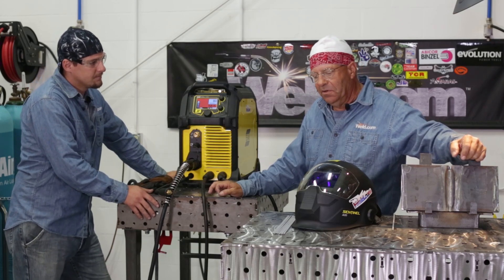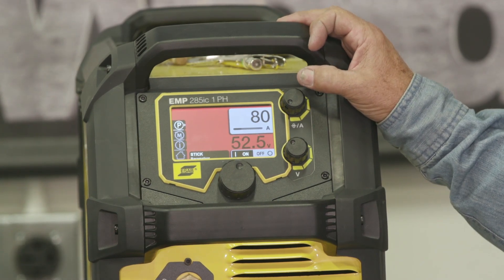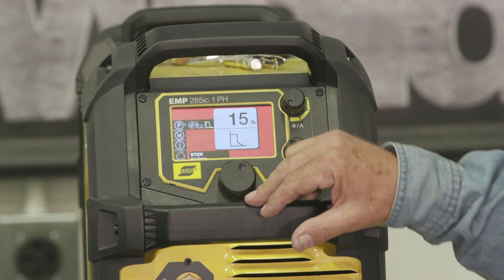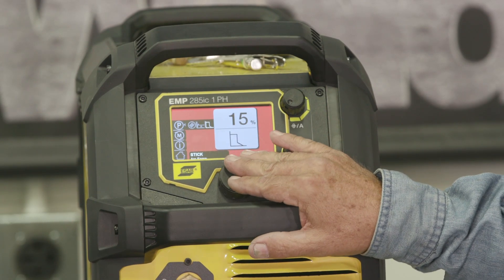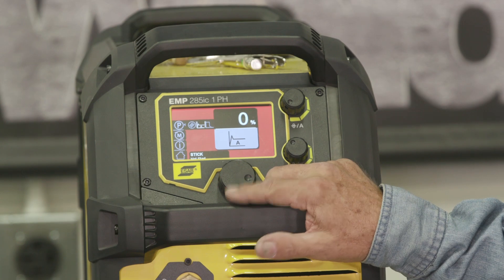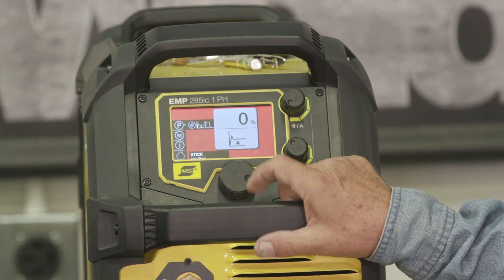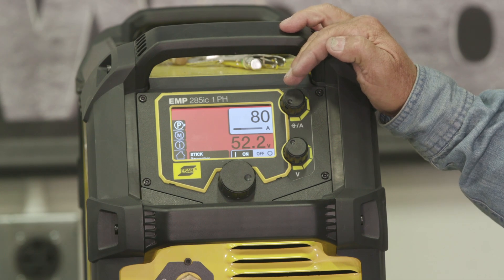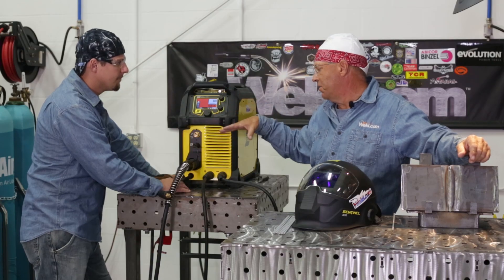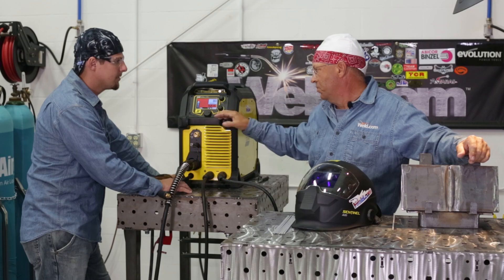So I want to make an adjustment here and show you what this extra little boost will do when we're stick welding. We're going to run 3/32" 7018. This was the arc force setting — I'm going to turn that back down to where we were before, where we ran it smooth. That's not what we're adjusting here; now we're doing the hot start. It's set at 20 — let's just go to zero, no hot start at all. We're at 80 amps, and we'll do one rod like that, then I'll turn it up to 50% and we'll see what value we get. It should give a couple of seconds of higher amperage to get going, then we'll continue the weld as normal.